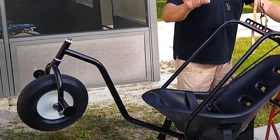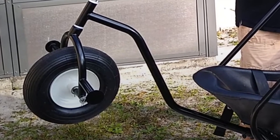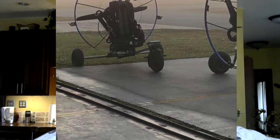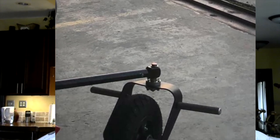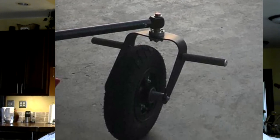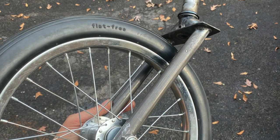I even considered Captain Kurt's Fly Pod for a moment, and one of the big things from his design that made its way into my final iteration was the castering nose wheel. In order to caster like a shopping cart and self-steer, any momentum to pull the front of the vehicle one way or the other — the axle of the front wheel needs to be behind the gooseneck mount for the fork. In his video about what most trikes have wrong, Miroslav talks about thrust line.